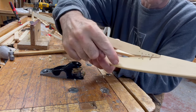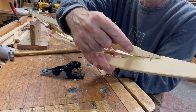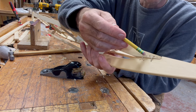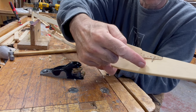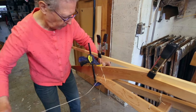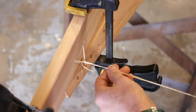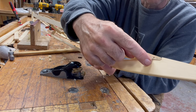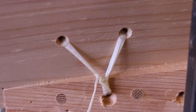So in the case of this stem needing to be up tight against the stringer here, when you lash these, you do just the first leg, the leg that is going to pull this in this direction into here. So you can do that lashing first, that'll suck it up tight. And then you do the second lashing and cinch them off. And in fact, you could do both of them that way. So you do the first one, you don't tie off the first lashing, you just leave it loose, it's just friction that'll hold it. But once you cinch them together, it all holds it together. And that works pretty darn good, actually.